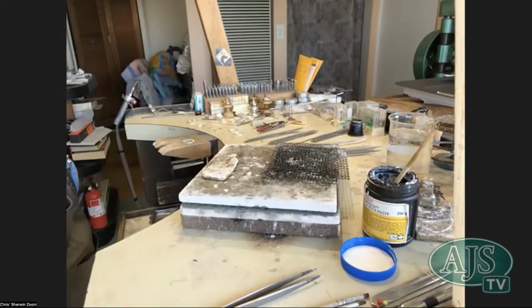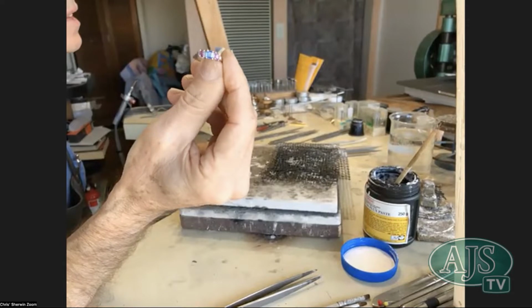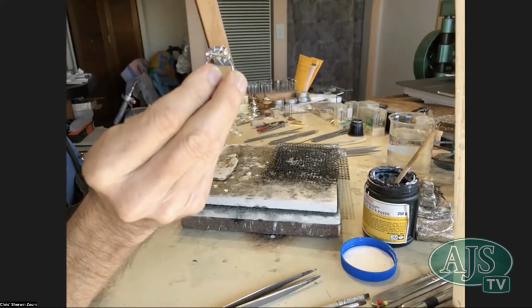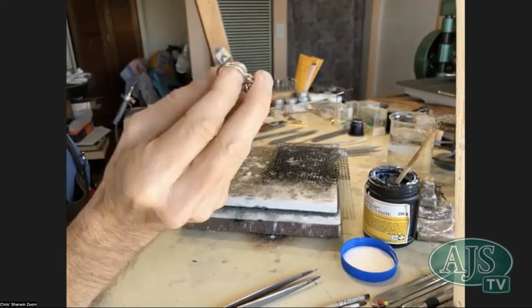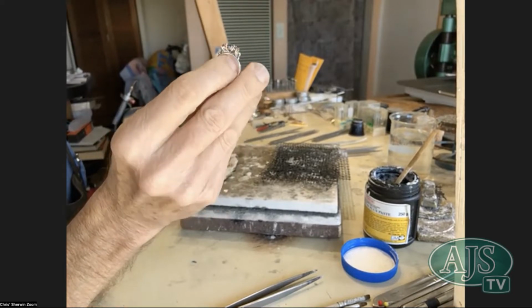Another ring that's possible to resize. This is a platinum ring with blue and pink sapphires, these are rings I've made. Again, the settings are over the top of the band, so you have to be careful here not to distort the settings. It is platinum, so you have to be very careful with heat, but that would be resized down at the bottom there. And as long as it doesn't come up too many sizes, that's perfectly resizable with care.